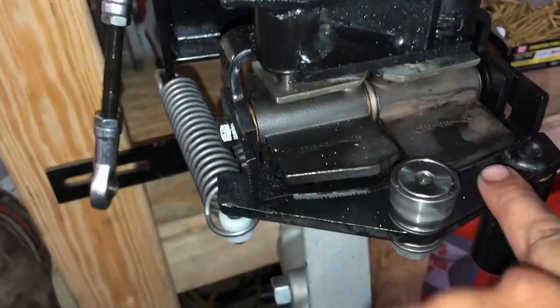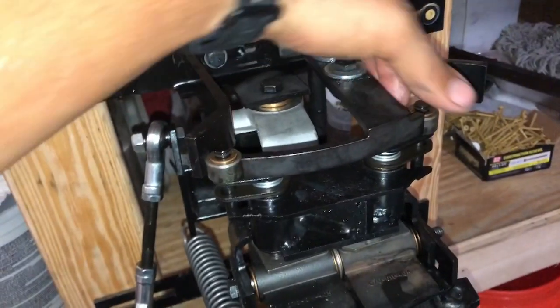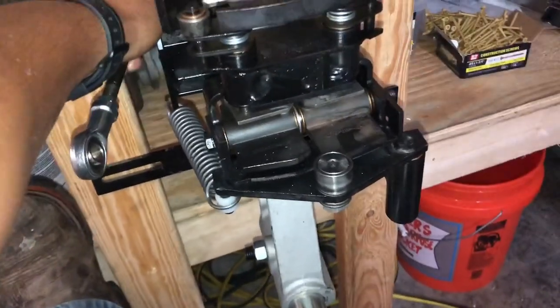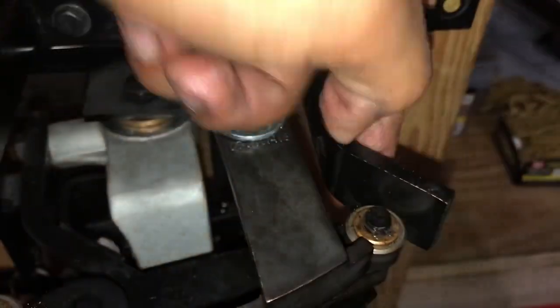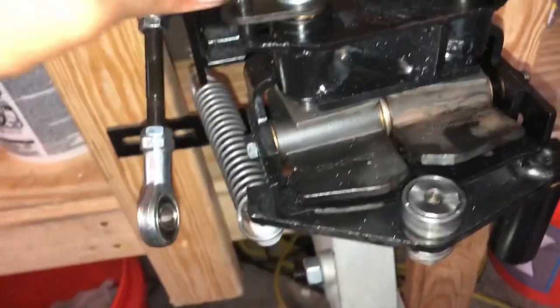You've got trip cams up here — this is your trip cam, and these are cam followers. These cam followers up here are connected to the cams down here. You can see when my trip cam pushes this cam follower back, it locks this down. So next time we try to drive that way, it can't slip because that cam's down in the way. Then when whatever resistance is here is gone — whether it's pushed the pin out of the door or the ball's gone up the lift — the whole assembly is going to be able to come back over.